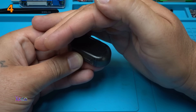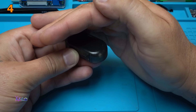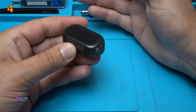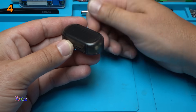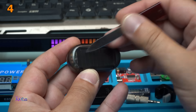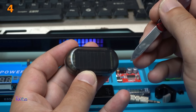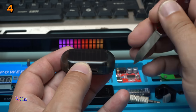It's blinking with a red light. I forgot to tell you that I ordered the red one, and it's working. When it detects solar light it will stop blinking, meaning it will blink only at night. Nine cells times 0.5 will give 4.5 volts for charging the battery — that's good.